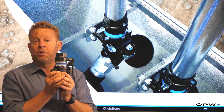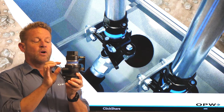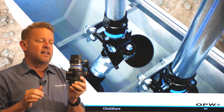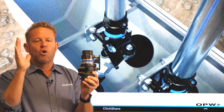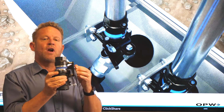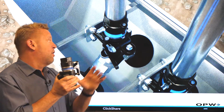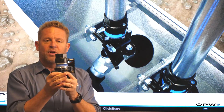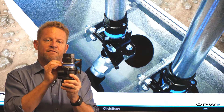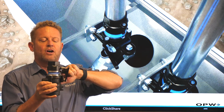There's now what's called a 10-plus version of our impact valve, where we have a shear top with the body and a shear groove. On this one, we have a rubber bladder that's secured over that shear groove. The reason for that is: many times what will happen is if that dispenser maybe is just bumped or rocks on the island due to high wind, and the valve cracks but doesn't crack enough to trip the valve, it could cause a crack that could potentially leak. What the 10-plus does — if that occurs where we have a nuisance break or a nuisance crack — our system's under pressure, and that pressure would actually swell that bladder, and as it swells, it would trip our valve.